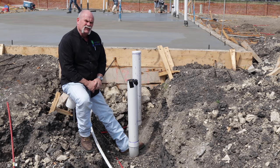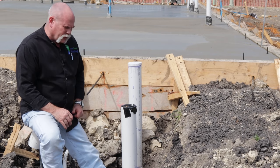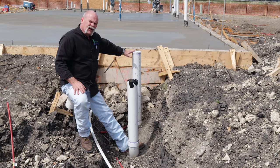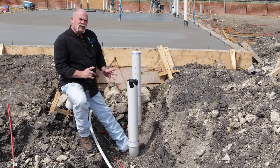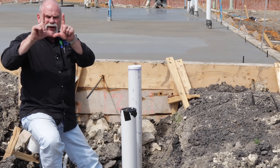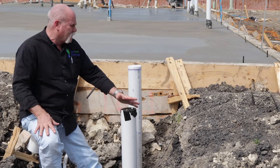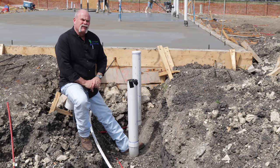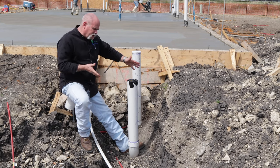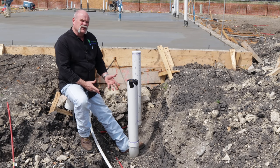What we have here are the two-way clean outs that we're always looking for. The two-way clean outs are outside your house, and this is where your sewer comes out and ties into the city sewer. The clean out furthest away from your house goes down and angles back towards your house; the clean out closest to your house comes down and angles out towards the city. If we're doing a sewer water test here, what we'd like to do is stick a test ball right between them — they literally make a U. That stops the water from coming down and going to the city drain. Then we can fill it up to the level of the slab so we know if there are any leaks under the slab. As you can see, this is why it's so expensive — we've got to dig a hole big enough to install a two-way clean out system to do a proper sewer test on the house.